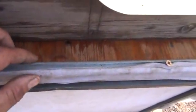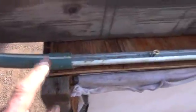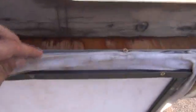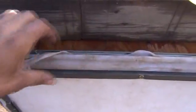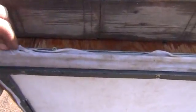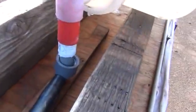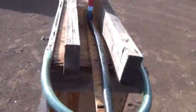Right here I have a piece of channel — this is actually from a window curtain with the aluminum panels in it, just a channeled rod. As you can see, it's just a piece of channeled aluminum rod. I stuck that up into the hose, and that's the same on this side. To create the wick, we have some extra t-shirt material stuck up above the frame. We take that and stick it right inside that channel. So from the five gallon jug, water goes down into that holder and hits the T-junction, then feeds both of those troughs evenly.